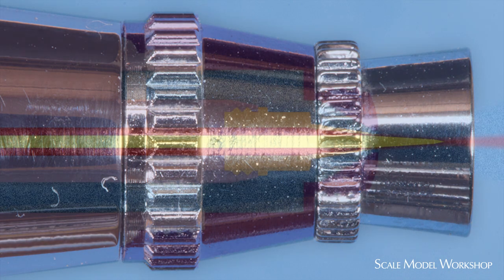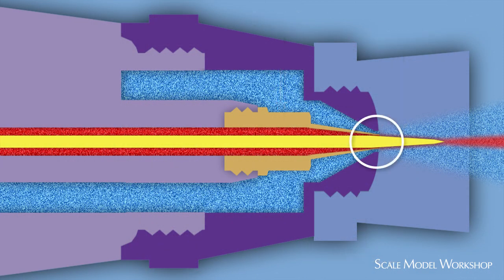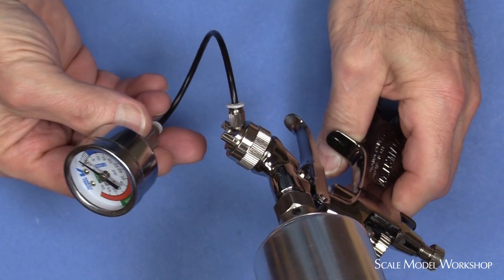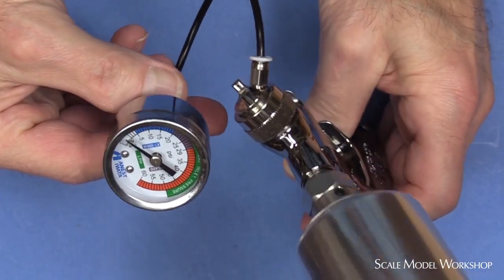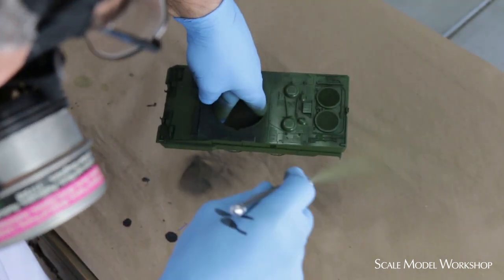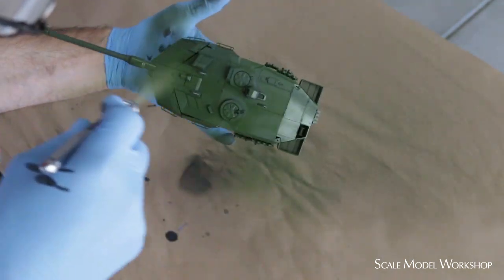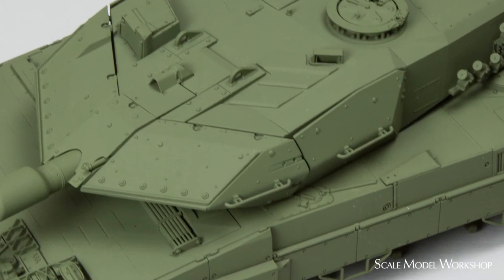relevant information to the equation, because the most important measure of proper airflow is the amount and velocity of the air passing over the needle, and in the real world, every airbrush gun has a different design, different internal architecture, and the viscosity and weight of the materials vary significantly. So even though you now have an exact read on your inlet pressure, you still don't know what's coming out of the air cap. That's why with HVLP spray guns, where air pressure is critical, it's verified with a cap gauge. So after all this, you can see that we might be able to discuss air pressures in a general range, but in practical terms, the actual resulting spray pattern and surface finish are what's important, and for that, we need to look at the other half of the equation, how you handle the material.